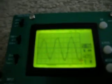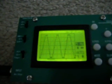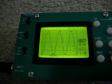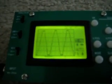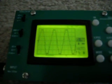As you can see, we have a very, very different waveform. The only thing I've done is I've moved near to the extension lead and put my leg on top of it. We're going to have to change scales. So, there's the body voltage right now. The scale we're on is one volt per division in the vertical direction, which basically means we've got six divisions going up in the vertical direction.